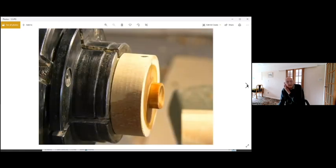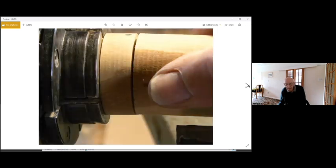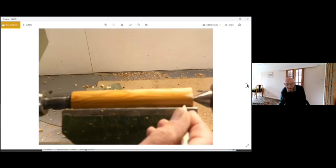Then I take it off the lathe and I put the lid on using the chucking point. And as this is the little piece you saw when I parted it, I concave the inside of it and make the body fit very snugly onto this piece, like so. I now turn it right down, put it on center. The piece has been cut, it's now on center. I've turned it down to 1.25 inch, 1/8 diameter.